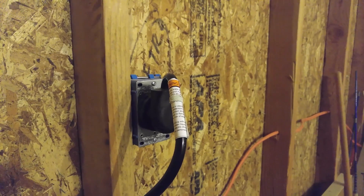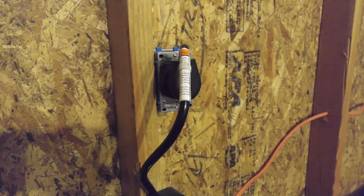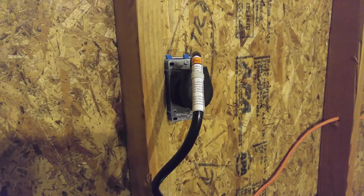I just haven't flipped it over, so I'm going to shut that off and flip it over. I installed this myself — 240-volt line going to a 30-amp breaker. Plenty for this.